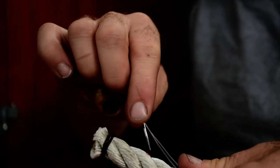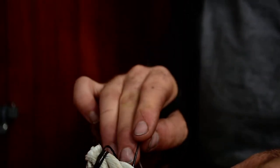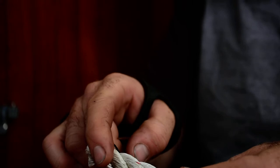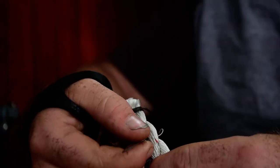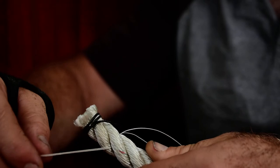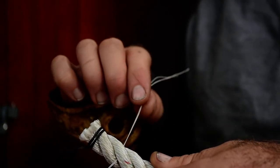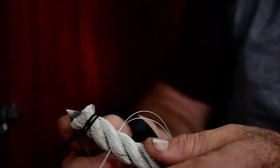To start the whipping, there are gaps between the three strands, so we come from right to left and pass the needle under one of the strands, getting it as close to the middle as possible to prick as few fibers as possible. I don't have a knot in the end of the twine — it's unnecessary because the whipping turns will capture the tails. Knots usually cause extra friction and can work themselves loose or get cut by chafing over time, so I leave two tails sticking out.